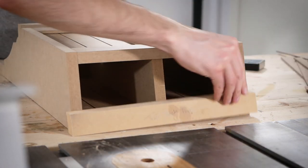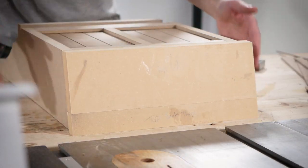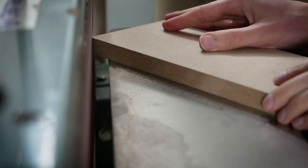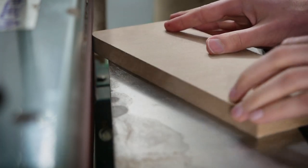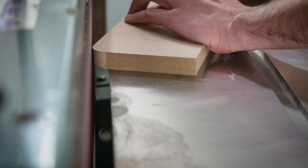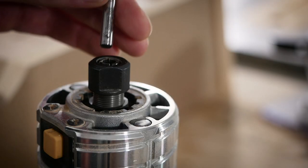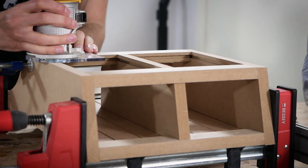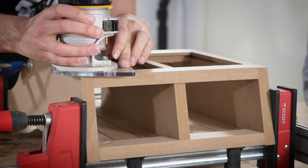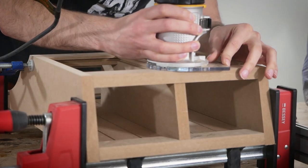Boom, like a glove. Quick decision — I rounded the corners on the bottom shelf. Speaking of rounding corners, this is my favorite roundover bit for this application. It is a 3/32 inch radius roundover bit by Amana Tools. It has this tiny 3/16 inch bearing on top, which means you can get really close into those corners without having to do that much cleanup afterwards.